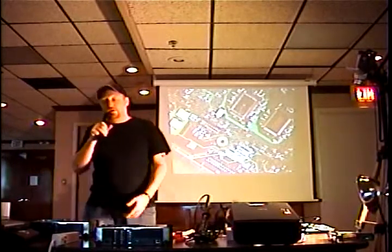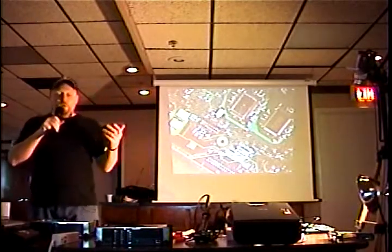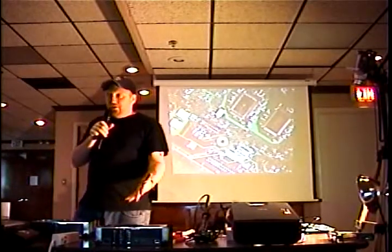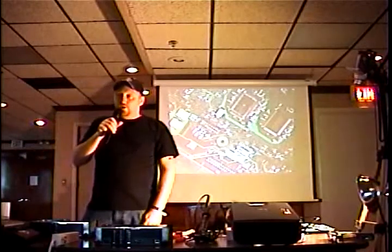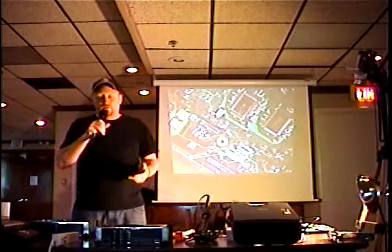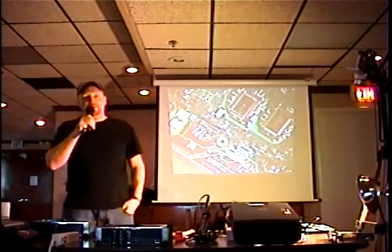Once you've unlocked the hard drive and you've saved your data, and let me tell you this, you don't need to unlock your retail hard drive, okay? If you don't plan on using it ever again, just toss it in the corner. But if you want to use it in a PC, you want a 10-gig drive, you've got a use for it or whatever, you'll need to unlock it. And when you boot from the auto installer CD, that's a good time to do that.